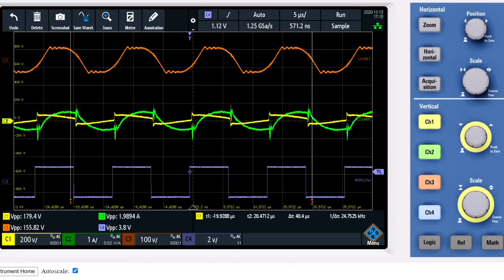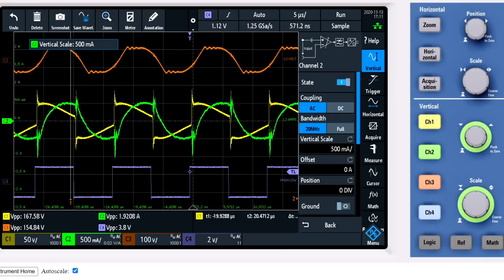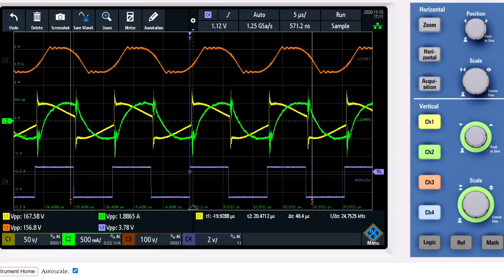But maybe for this to work, the L2 coil needs to be flipped over. Here's the probe shot. And I'll resize the L2. Now the L2 looks pretty weird. It's a bit chopped up. And the current also. It doesn't look like a sine wave anymore. Although the L2 coil is on top and loose coupled to L3, now it shows a very different waveform. This setup needs to be further fine-tuned and investigated, but that is all for the future.